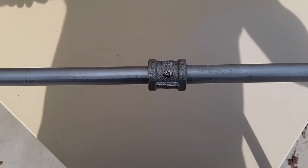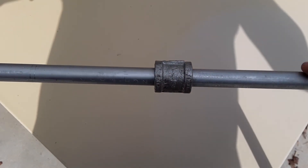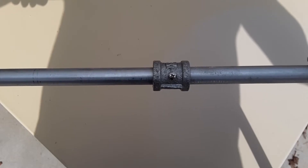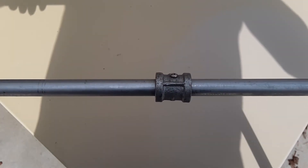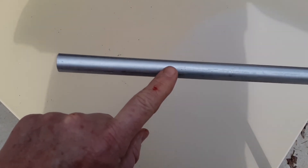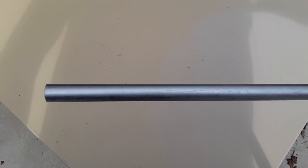This is the finished product of the coupler and set screw. It was easy to get it down the conduit by hitting the edge with a hammer — the threads gave way a little and allowed it to go further down. Then I just drilled a hole through and ran a machine screw through there. The next part was to drill a hole in the bottom for the eye bolt, and then put about a 60-degree cut in the end, which will be the point that allows you to stake out your kayak or boat.